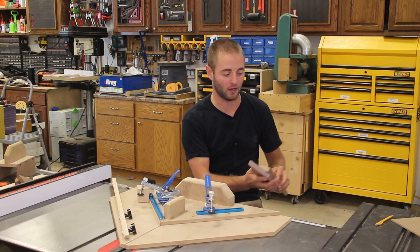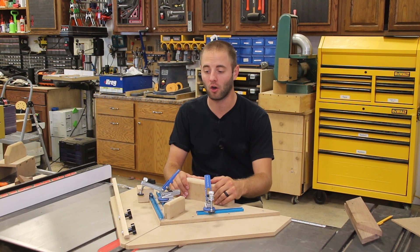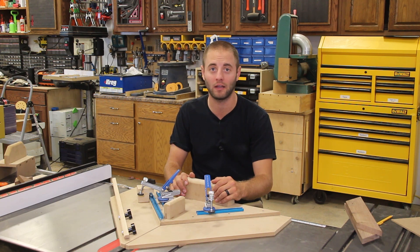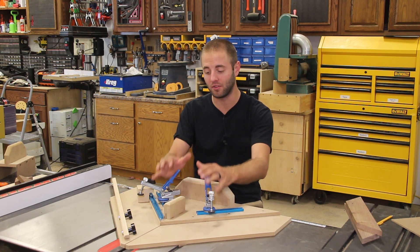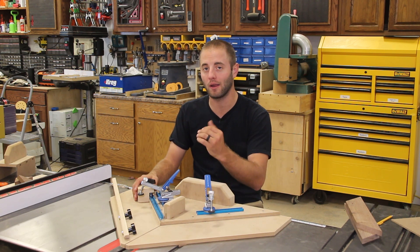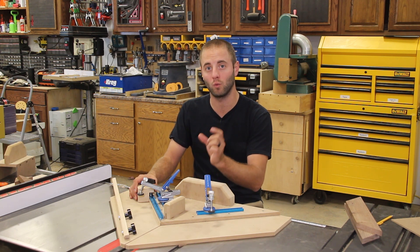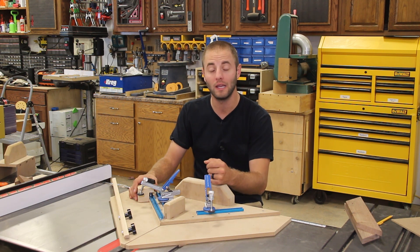Well, what did you guys think? I think the perfect 90-degree miters speak for themselves — this jig was an absolute success. Miter joints are not something that's hard to do, they're just tedious to set up, and having a permanent solution in the shop to simply grab, slap it on the table saw, and get perfect, accurate, repeatable results every single time is very welcome. I love how the jig turned out with the auto-adjust clamps, the safety features, and the stop block system. Stop blocks are a must-have in scenarios like this, because it doesn't matter how accurate your miter joints are — if your matching parts are not the same identical length, your joints will not be perfectly 90 degrees and you will have gaps.